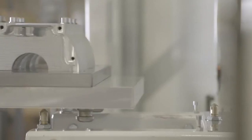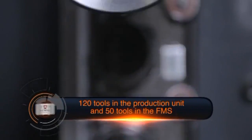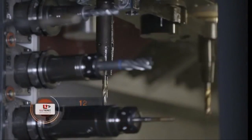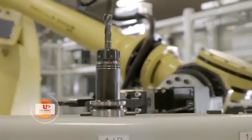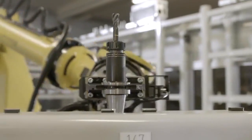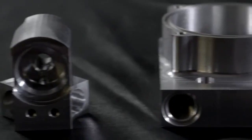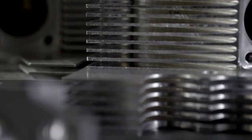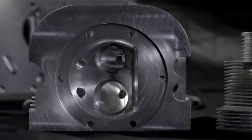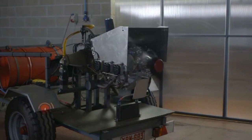The thrust-to-weight ratio on these engines is awesome. In the last couple of years we've been hearing a lot more about fuel injection — not new in automobiles, but fairly new in aviation engines. What's awesome about UL Power is it's direct-drive air-cooled, which is traditional design, and then the modern technology: it's got multi-point fuel injection, dual electronic ignition, and FADEC. The ECU has sensors on the engine sensing temperatures and pressures, and based on that information it knows what to do with the spark and the mixture. In the cockpit, you just have a throttle — the ECU is constantly controlling the spark and the mixture.